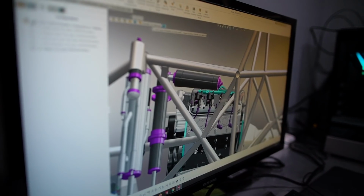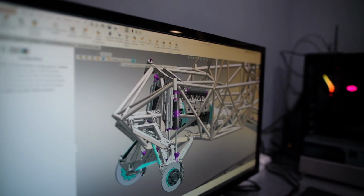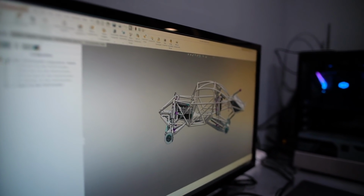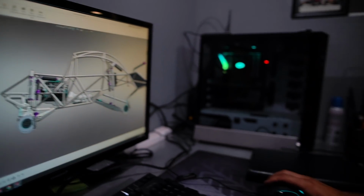It's a big dog. The motor sits super low in this chassis. We literally went as low as we could get it with a shallow oil pan. It helps to line up the drive line better, keeps the center of gravity lower. Basically, all advantages when you mount the motor as low as possible. So, more foot room, more clearance in the interior section of the cab. This thing is going to be a mean machine.